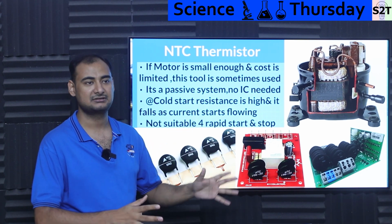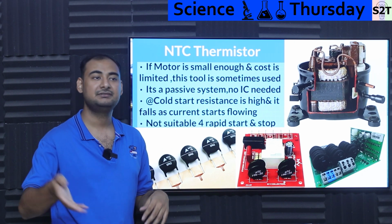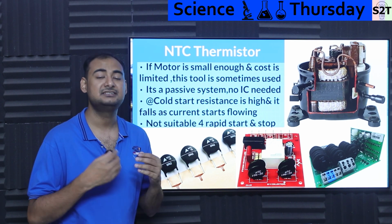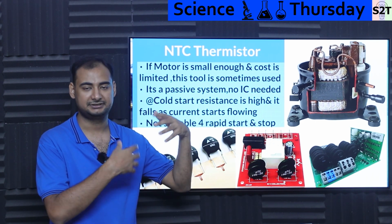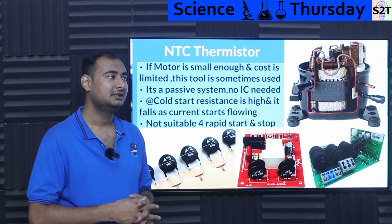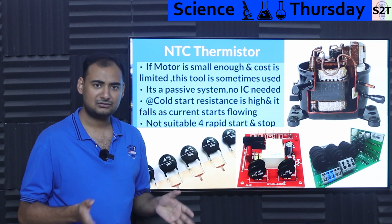We just have a system which basically takes the AC, makes it into DC, charges the battery. And when the power goes away, it takes the DC from the battery and then gives us AC, and we run our appliances. It's a common thing. 6 years ago, when I started to run this channel full time, I bought a bigger system that had like 2 batteries, as in 12 volt, 200 amp hour batteries. And I had like a 1600 watt inverter. It's a normal thing for us.